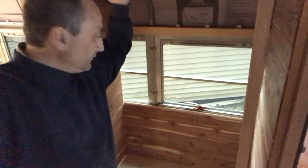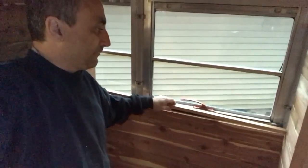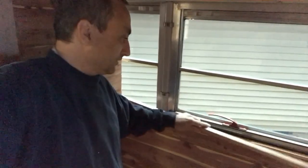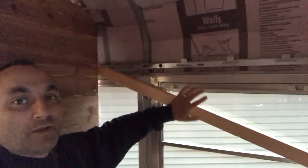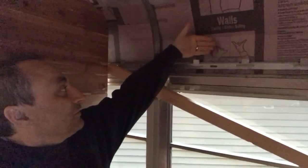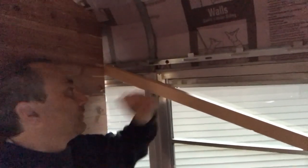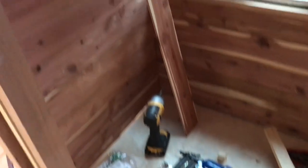Good morning — it's a chilly morning here in Maine, early October 2018. It's been a few days since we were working on the closet and I'm hoping to finish it up today. I had this scrap from something else — it's not cedar but the color matches — so I'm going to use that to cap this section right here. What I'm working on right now is putting a board on here that'll get screwed in, then hopefully have enough cedar to go over it, creating a little pocket channel that runs the whole length of the bus. That pocket will be the channel for any future wires I need to get into the closet for lighting and things like that.